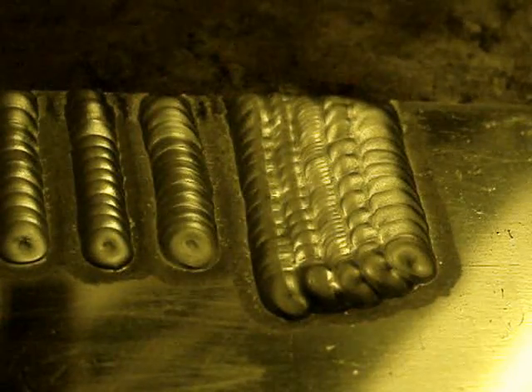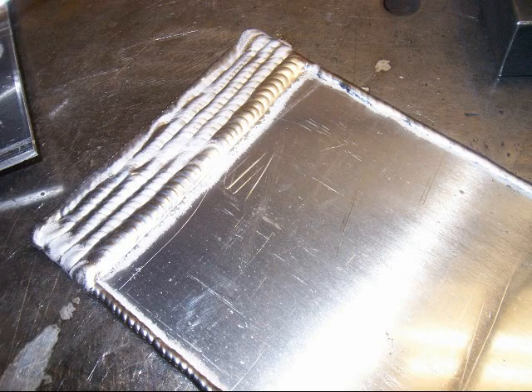The reason for using aluminum is it kind of exaggerates things that go wrong with steel, but it also doesn't require cleaning between passes, so you get a lot of seat time and arc time practicing different things. It also exaggerates heat conductivity, so you have to work the foot pedal more and learn to feed that rod. Your feed hand will have to learn to catch up and be as skilled as your torch hand — it's always the feed hand that lags behind when you're learning. Welding aluminum, because wire feeds so easily into the puddle, will make you get better at it. So get a piece of 11 gauge aluminum — 6061, 3003, 5052 — even if you just get it at the scrap yard, it doesn't matter. It's practice; it'll teach you how to be a better welder. These skills will translate right over into stainless steel and carbon steel — it'll make a better TIG welder out of you.